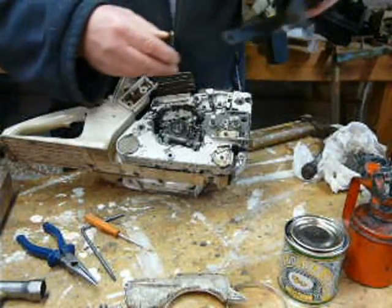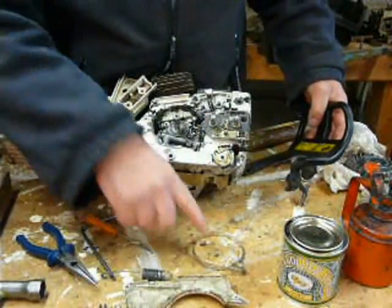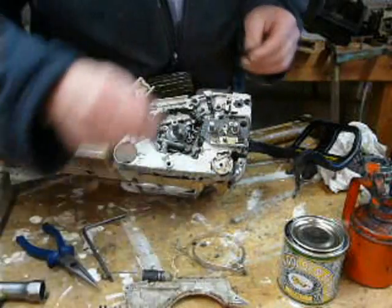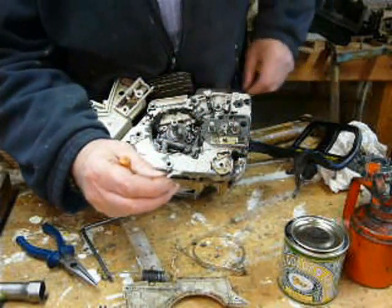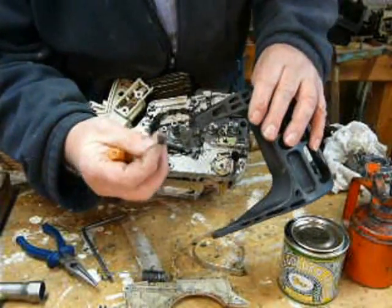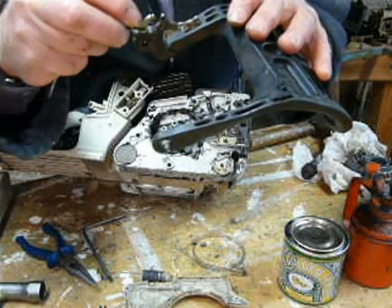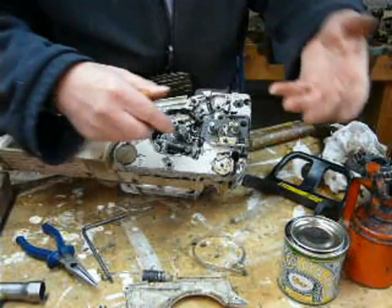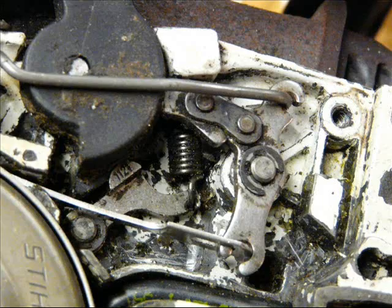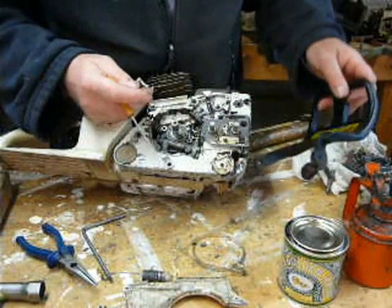The chain brake fits like that, and various other big springs. Brand new chain brake band. Just bring to your attention this little bit of kit here — there's a little sort of shoe there, and that shoe runs against that part on the chain brake lever. So if you've got a chain brake lever where the actual handle just flops about, it's that little spring — it's a 10-minute job to change it, but it's worth it. Then you've got a positive action with the chain brake.